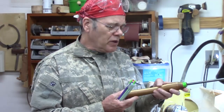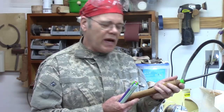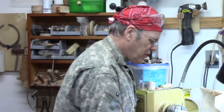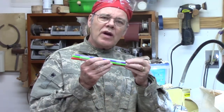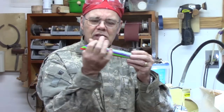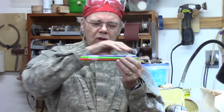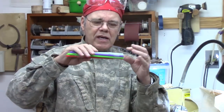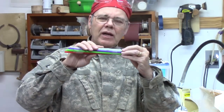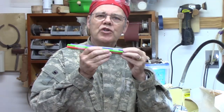That works real well. You put the carpenters glue on there and glue it together and the glue joint is stronger than the actual wood. But with woodturning, sometimes we have a need to glue end grain to end grain. Think of two bundles of straws, because that's basically what a spindle orientation piece of wood is with all the straws, the capillaries. We know anybody who works with wood that that is a very weak joint.